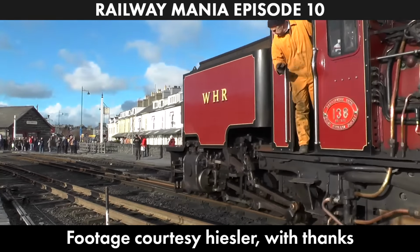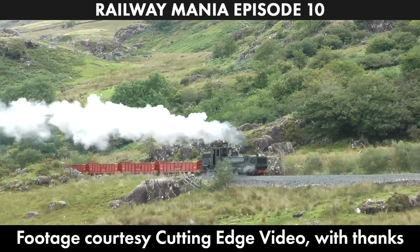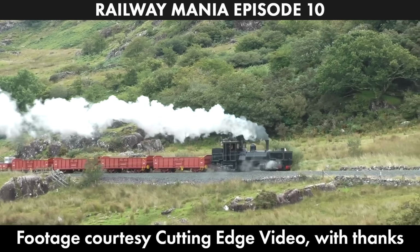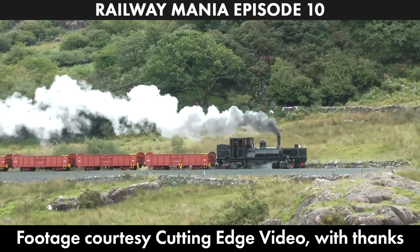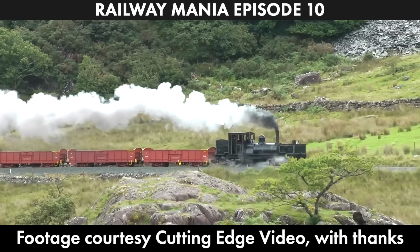So it has the high pressure cylinders at the rear end underneath the cab, and then it has the low pressure at the front. The exhaust from the rear unit powers the front unit. So the steam has to travel down the length of the locomotive, back on itself. The main steam pipe on K1 actually comes off, I think it's on the side of the firebox, where the regulator is.